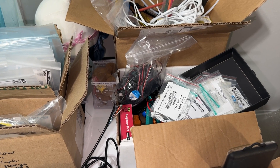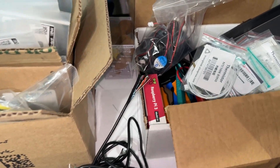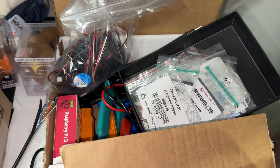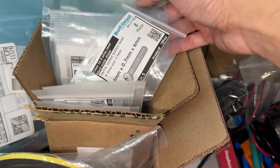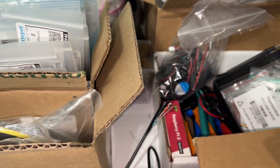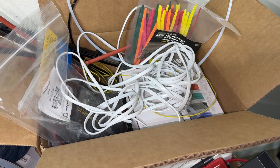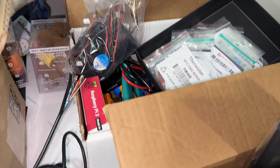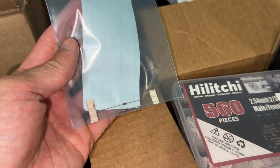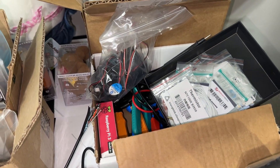The fourth video was buying parts, which applies more to self-sourcers. The mistake is not buying the right parts, and also not buying extra bolts, thermistors, heaters, and parts that take forever to ship. I still have many spare parts, but it's better than running out of something during the build. There is no official agreement on what constitutes a stock Voron build — the printers are constantly improved and updated before the documentation. Some parts in the BOM, such as the BAT-85 and ADXL345, may already be soldered somewhere like the Toolhead PCB, so it's up to you whether to buy extras.